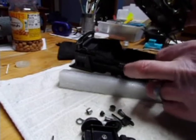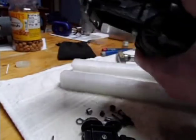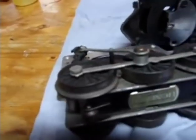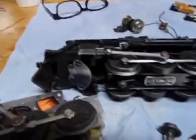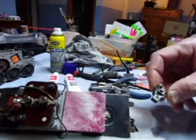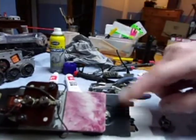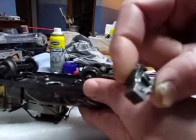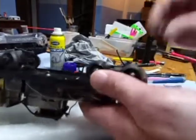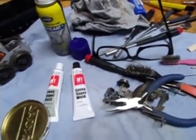I'm going to put this back together and then finish this video. Also I have this spacer that I need — it's going to go in here — because that's just a piece of tubing which doesn't match. I was trying to get this coupler on here and I attempted to solder it, and what happened is what I thought would happen: the solder stuck to the frame no problem at all, but it would not stick to this. This is pot metal or aluminum, something like that, so the solder doesn't stick to it. So I got some epoxy that says it'll stick to metal — we'll try a little epoxy and see what happens.